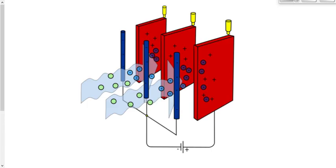Everybody has a filter in their furnace. You guys know that most of the rooms in your house have what's called a cold air vent. There's the warm air vent on the floor, but then there's the cold air vent on the bottom of the wall. That's a pressure thing, right? If we pump all this warm air into a room and we don't suck any cool air out of the room, then it messes with the pressure of the house. So we have this cold air vent that sucks cold air in, goes down through the ducts into the furnace, and then that cold air gets warmed up in the furnace and gets pumped back up into the rest of the house through the warm air vents.